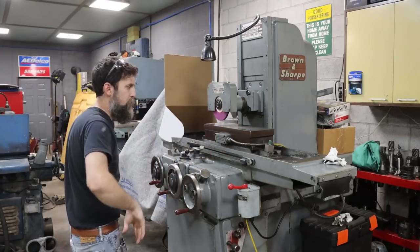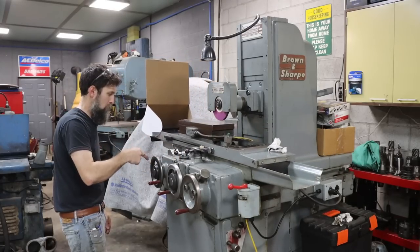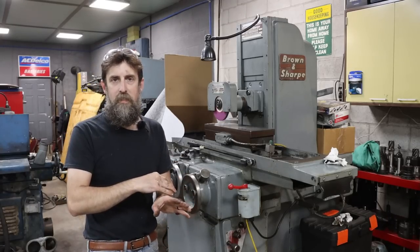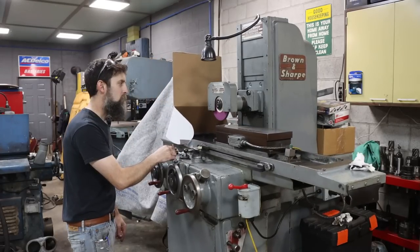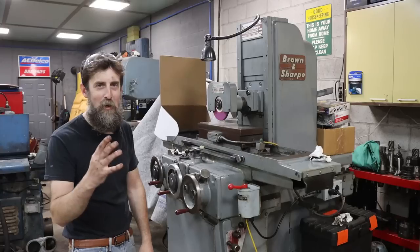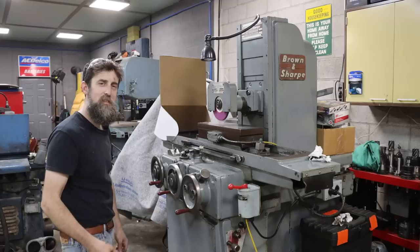This thing's been running for three or four minutes — enough time to circulate through the system. It's definitely quieter. Does it make any difference at all? It does. I'm going to be 100% honest: I fully expected adding oil to do nothing more than quieten it down. That is working like it should. I fully expected that to do nothing to the hydraulic — I thought for sure this thing had some sort of O-ring shot in it and I was prepared to tear into it. But there you go. That's what it was — the system just had air in it. The more you know.